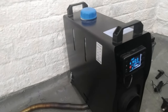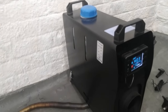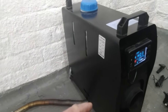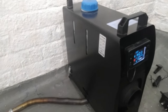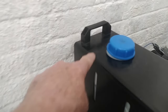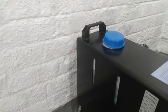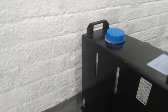It's started up again. For those of you not familiar, this is the general startup - there's a glow plug in there, takes about two or three minutes to warm up until it's hot enough to burn the diesel or kerosene, which we've got in this case because it's cheaper. The ticking noise you can hear in the background is the diesel pump as it starts up. It can be a bit annoying, but if you have a look at my other videos there are a number of ways to get rid of that noise.